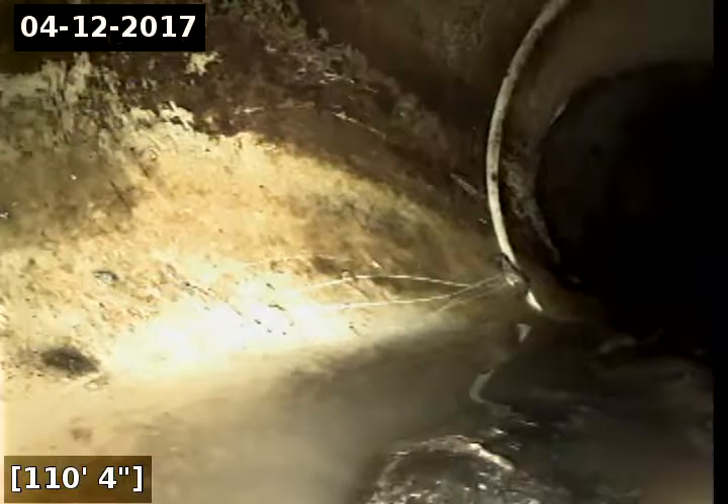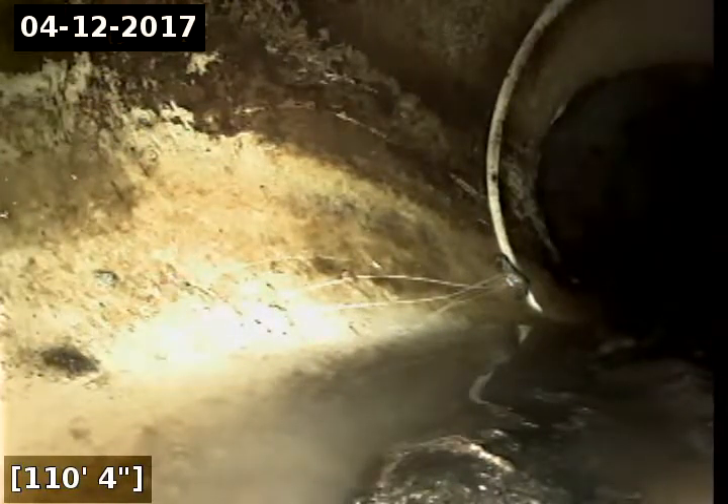We ran every fixture in the house for quite a few minutes including the toilets, and the water never rose up or started to pool or swirl in any of those three dug-out areas. They're holding water because they're just lower than the regular dirt throughout the rest of the crawl space. The irrigation system will need to be looked at, along with possibly adding rain gutters as the foundation people mentioned. We could find no current active leaks on any of the copper water pipes under the house and/or the drain or sewer lines contributing in any way to the three little pools of water under the house.